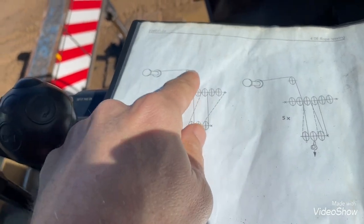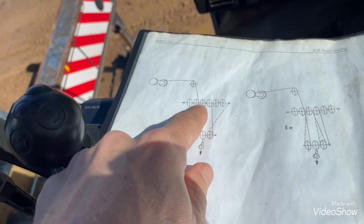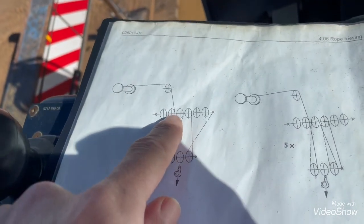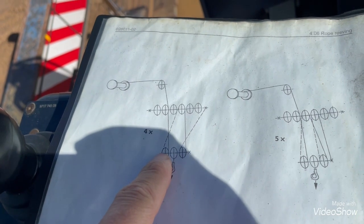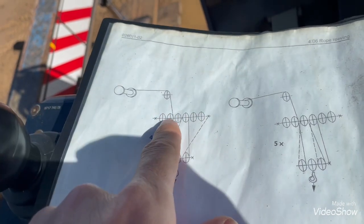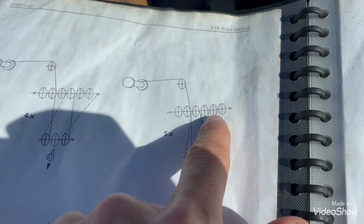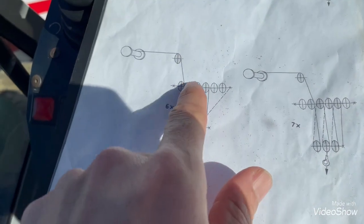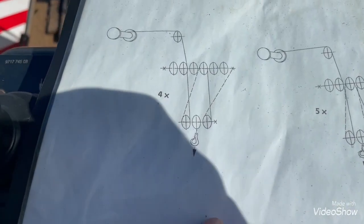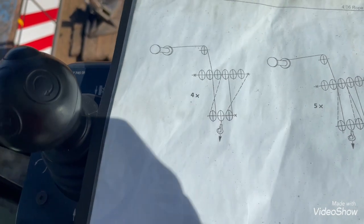This shows which comes off your top pulley to your second pulley. It always comes on the second pulley, only if you've got another configuration. So off your second pulley, it's obviously the outside one and the outside one when you do four — so it's two and four. Whenever I look at this pattern, I just look at which one it is: two and four. If I'm doing five, it's two, three, and four. If I'm doing six, it's one, three, and four. So you memorize that. I'm doing four, so I'm doing two and four — that's all I've got to remember.